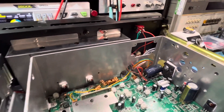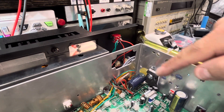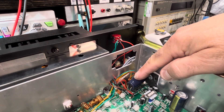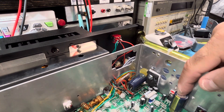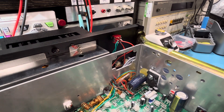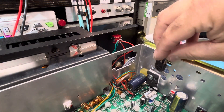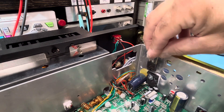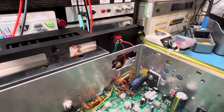Inside here you're going to see these are your new larger capacitors. This is your incoming filtering cap for your power, this one goes to your power regulator, and we also updated the power regulator — it's much larger than the original one. You can see the size of the original compared to the new one. You get a lot of extra heat dissipation on that, and that's the reason we put it on there. It doesn't give you any more power — it's more of a safety thing.